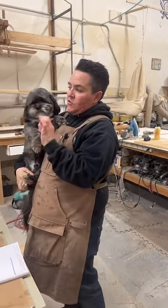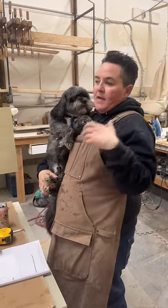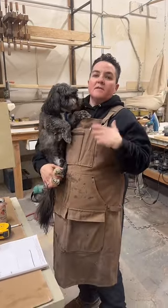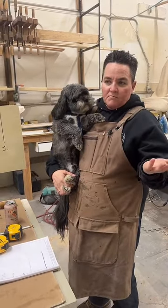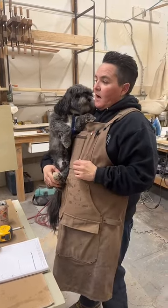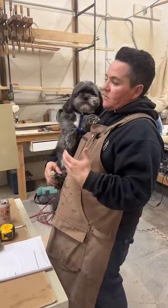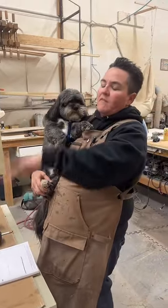Yeah, in cabinetry, it is usually down to the 16th. It really depends on what you're doing, but in most of your guys' things, let's take framing, for instance. Things can be within an eighth of an inch, maybe even a quarter, depending on your industry standard in your state. But the whole point is that you don't have to get familiar with 64ths, 32nds, all of that. Don't even worry about that.